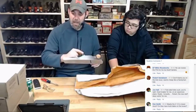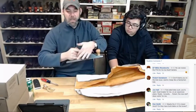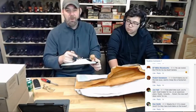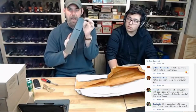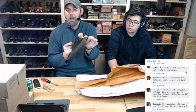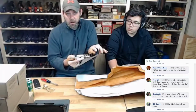I've got big hands, guys. This is a number five, and this is how I hold the plane. As you can see here, we're almost wrapping the pinky around down under here, and I usually will use a plane like this in this position. This finger right here is a guide against the board, unless I'm going across the face, obviously. But if I'm going along the edge to joint, this is how I'm going to hold it. So that's what I'm gauging comfort on.